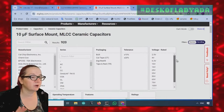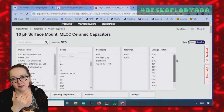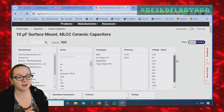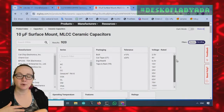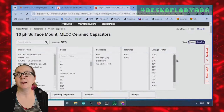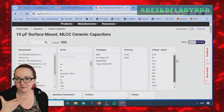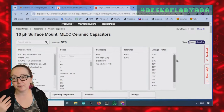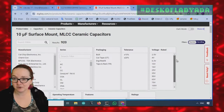Next up, your voltage rating. In general, you want to use the lowest voltage rating for your situation. If it's a 5-volt power supply, use 6.3-volt. 8-volt power supply, 10-volt. 12-volt, 16, right? You always go a couple volts up, and that's your voltage rating. However, I don't want to stock 5 different voltages for different use cases, because a lot of my stuff is 3-volt or 5-volt. So should I get 6.3? Well, you saw that little boost converter goes up to 12 volts.